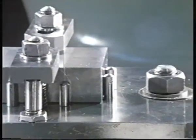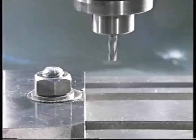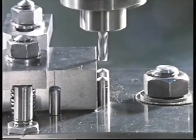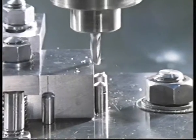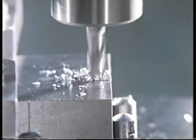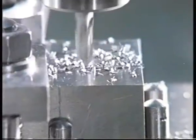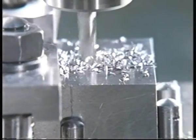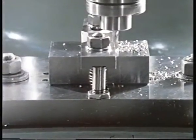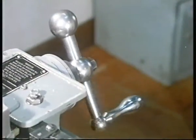We've mounted this component on a milling machine. Let's take a cut. In this operation, the cutting forces acting on the component are relatively small. In fact, the forces are so small that the metal dowels aren't really necessary. So let's do away with them. Now, in 2 directions, we're relying on a frictional restraint obtained from clamping forces.